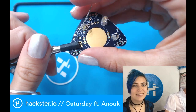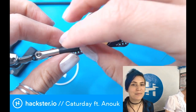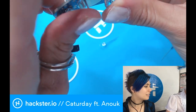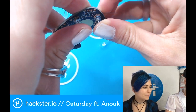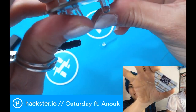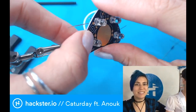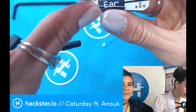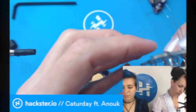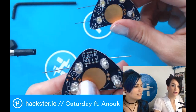Cool. So let's see if it all goes in. What I mostly do is I just take this off and I spread the legs, so it's easier to solder. I don't know if you can see that. Just flipping it here, flipping at the other side. They're all pulled out to the outside. Yeah, correct. Ta-da! Sweet. So it's easier to solder at this side. I'm also going to do that at the other board. Basically all the LEDs are in there now. You can see here.